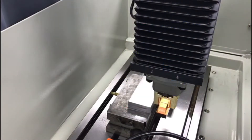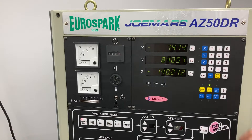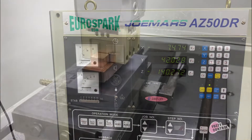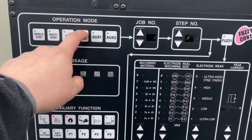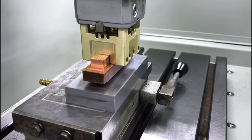I'm going to do exactly the same thing on the Y. I'm going to use the half function on the Y, and when I bring it to zero, we should be right in the middle of the workpiece. To zero the Z, we're going to use the edge find F4 function. That will drive the head down until it touches the workpiece.